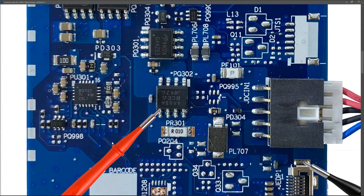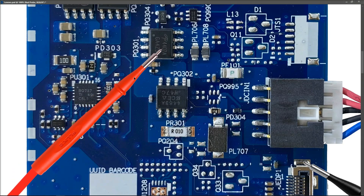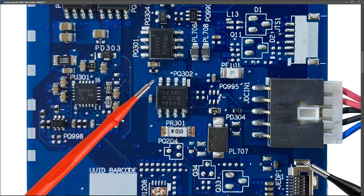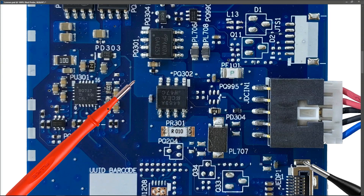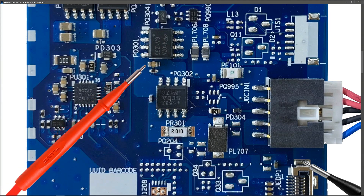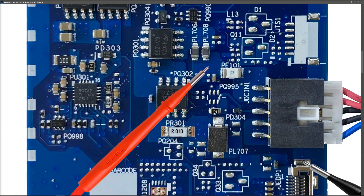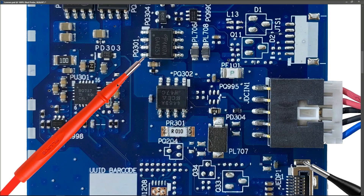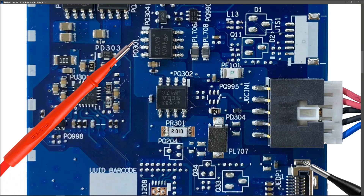Okay, I hope you've worked it out. I'm not even sure it's possible to fully work it out from what I've described. I've removed all the markings for the moment just so we can focus on these two MOSFETs. This is a 4407A. This is a 4483A. It's a 4407 ending in an odd number — that means this is a P-channel MOSFET. This is a 4483 ending in an odd number — this is also a P-channel MOSFET. We've seen that with N-channel MOSFETs normally on the inputs of these types of laptops, the two gates tied together would normally be 25 volts or so. But that's for N-channel. To switch on a P-channel, it should be a lot lower. But still we're getting 20.44 coming through here — so what do you think is happening?